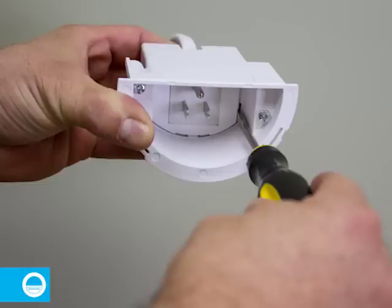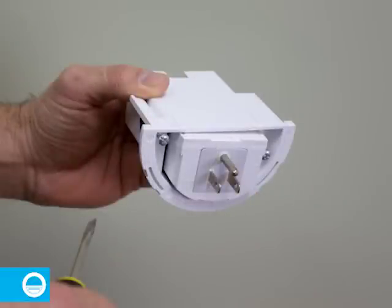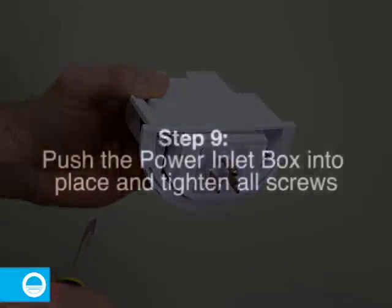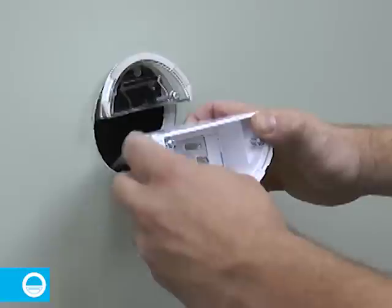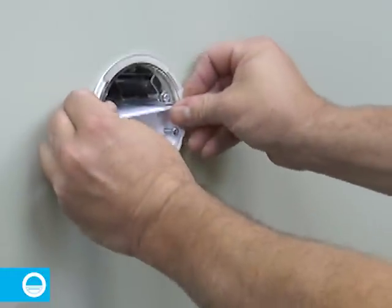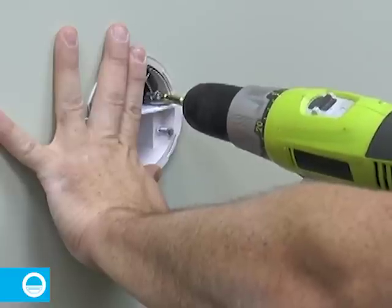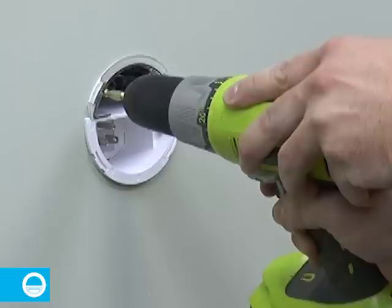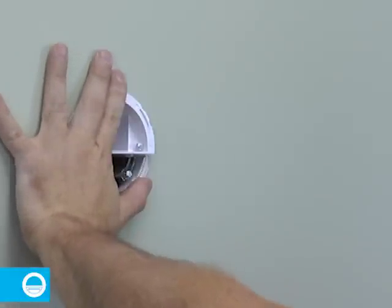If access is needed, the insert can be removed using one or two small screwdrivers — start on the sides by inserting a screwdriver near the side snap features, gently pry the sides, and push the insert forward. Once the insert has overcome the side snap features, move the screwdriver to the top and bottom snap features and push the insert forward until it comes loose. Push the power inlet box into place. You may need to manipulate the NM cord slightly, but make sure not to overstress or scratch the cord. Look at the bottom box set and adjust until positioned correctly. Tighten the mounting screws — be careful to maintain constant pressure and do not over-tighten; just make them snug to slightly compress the gaskets. Move to the top box set and repeat.